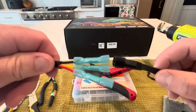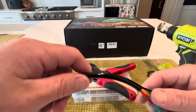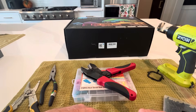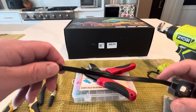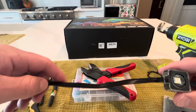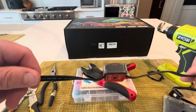That's the connection sequence — that's all you have to do. Before you do all this, make sure you plug your lights in and confirm they're all working before you start cutting. That way, after you make a splice, you can go check that the lights on the other side still light up on both sides. If you didn't check your lights beforehand and made your splice and it didn't work, you could be chasing a ghost — they might not have worked to begin with. So that's a very important first step.